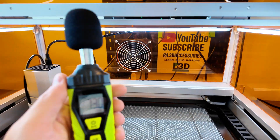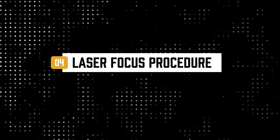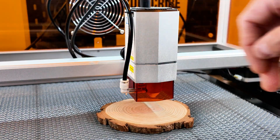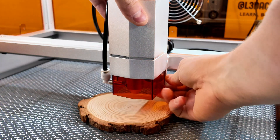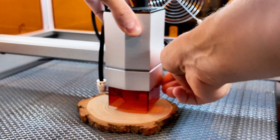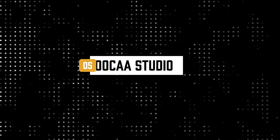We'll move on now to the laser focus procedure. This is something that you do manually and you've got a nice arm that is part of that laser module. And then on the right, just a single lever, which is great. You lower it down until the arm on the left touches, lock it in place, put the arm up and you're good to go.